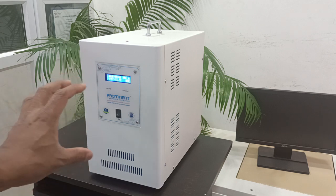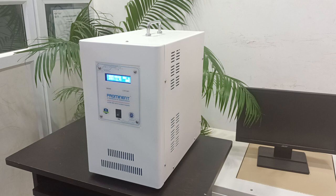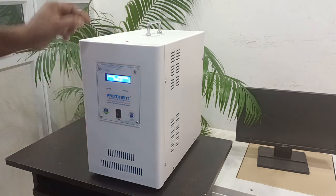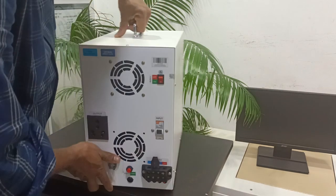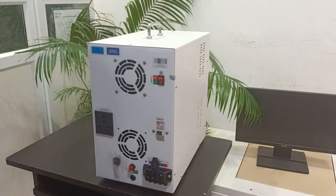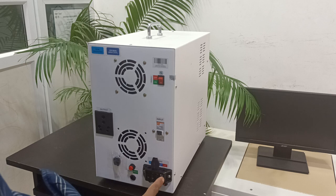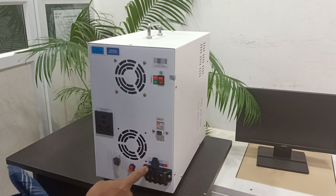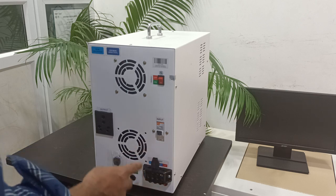Within the 1kVA power rating. This one is the inverter on/off switch. Here we need to connect the phase input; the second one is no connection; this one is the neutral connection; and the fourth one is the line output — the inverter output.